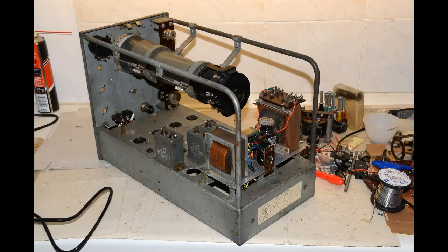Here is the new power supply module fitted to the back of the main chassis. The notes on this A4 sheet show the wiring up of the power supply to the CRT from the main circuit diagram to both HT plus and HT minus, with those connected in. These provide the voltages for the spot and adjustments on the CRT screen. The components seen on the sketch are in fact those which are to be fitted next.